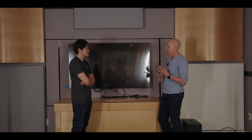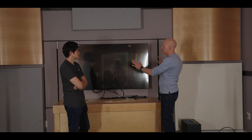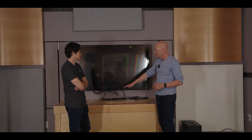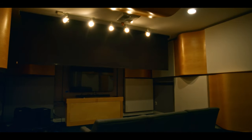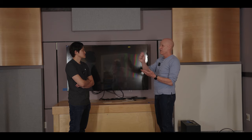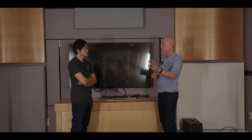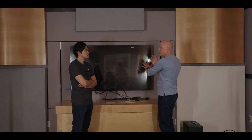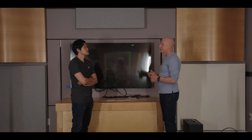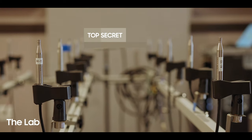We can mount TVs or sound bars on this four-sided wall and they get strapped in at exactly the right location. We close the door, and the difference between comparing two really good speakers comes down to about half a meter of position difference — if you're not controlling position, you're not really learning which speaker sounds better. When you think about a sound bar, all the speakers are running all the time — whether it's 5, 7, or 11 channel — you're energizing the whole system.